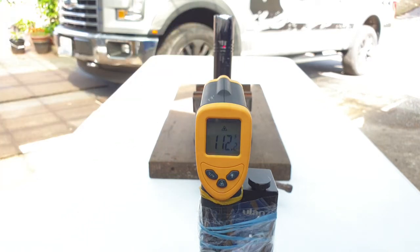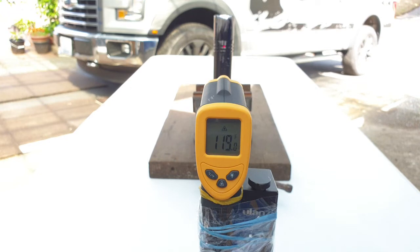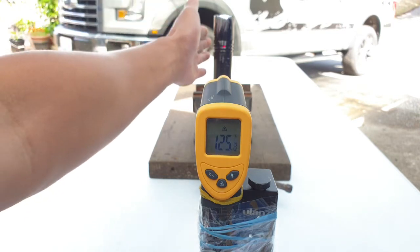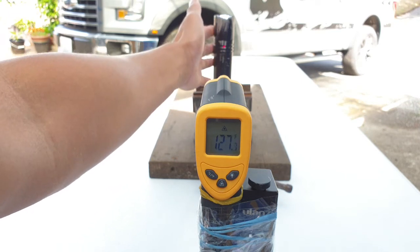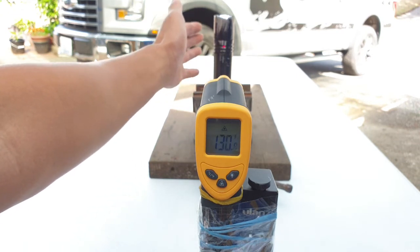Just warm, not hot yet. This is a much higher drain cell, but as you notice, it's also a much lower capacity — 3000 versus 4800 mAh, and the Acebeam one even does 5100 mAh. So this is good if you only run your lights in short bursts. The light does get hotter a lot faster, so it's already getting rather warm.